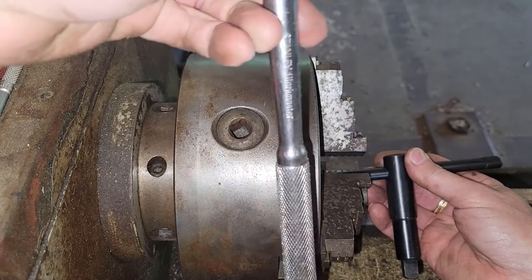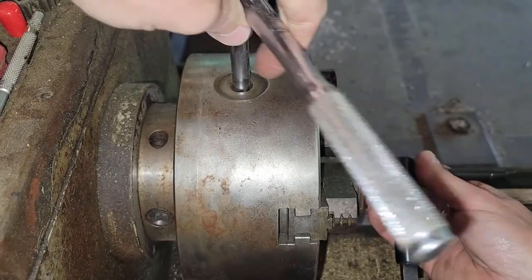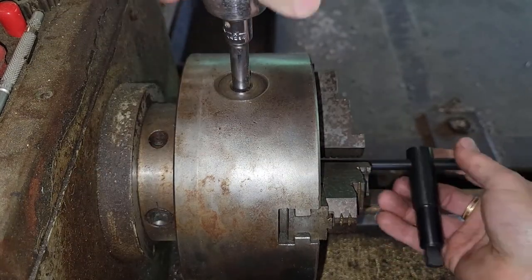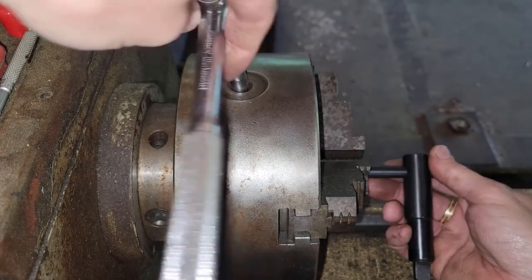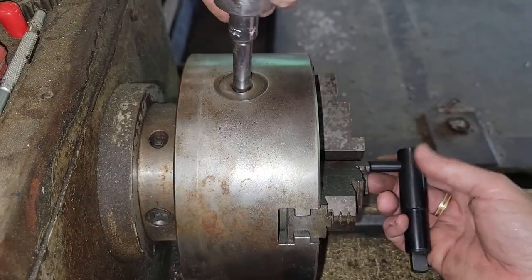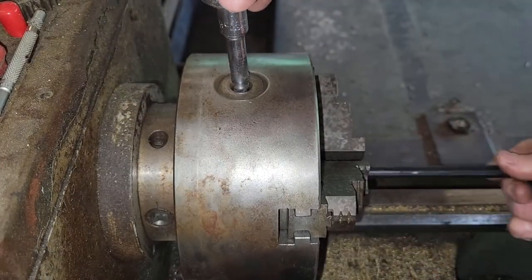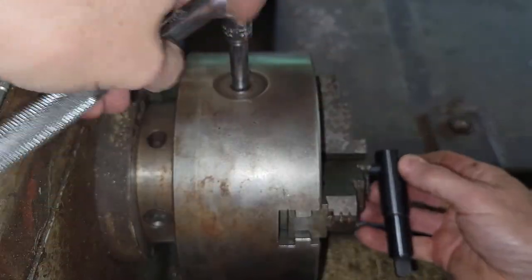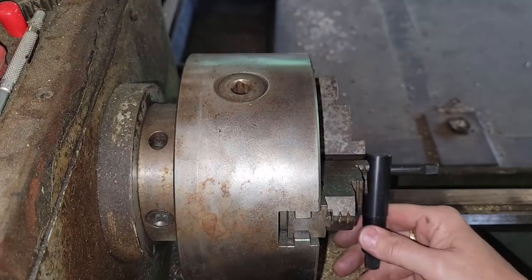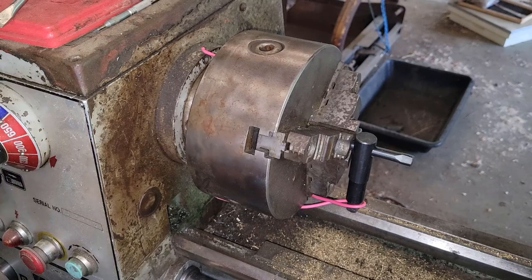Maybe I'm going to tape the handle up against the jaws and then turn the swaging off of the end of the handle so I can slip it off, and I can put this in the chuck. And turn those corners off until it fits. Let's see what I can tie this back with. I think if I keep the RPMs low, I'll be okay.